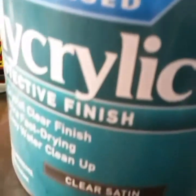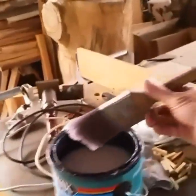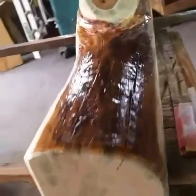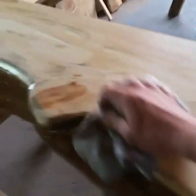We're using polyacrylic, putting it on with a good brush. Let's get on this last coat — we'll start down here on this end and work back towards the can. We'll let this set up, then roll it down and do the top. We've given that time to dry on the front, now we just block sand the top before we apply this last coat, then wipe it down and apply.